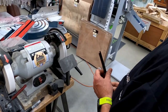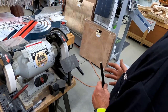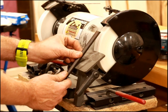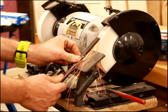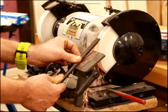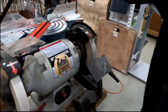By the way, this is a slow speed grinder — it's 1800 RPM. Try not to use a high speed grinder because it gets too hot too quick and removes stock way too fast. Pretty much all wood turners who use a grinder recommend finding a lower speed grinder. To start off with, I'm just going to hold the tool up high on the tool rest, come in, let both ears make contact, and just work it down. I'm not even positive which stone I'm on, whether it's the coarse or fine — it really doesn't matter for what I'm doing. I'm just grinding it back.